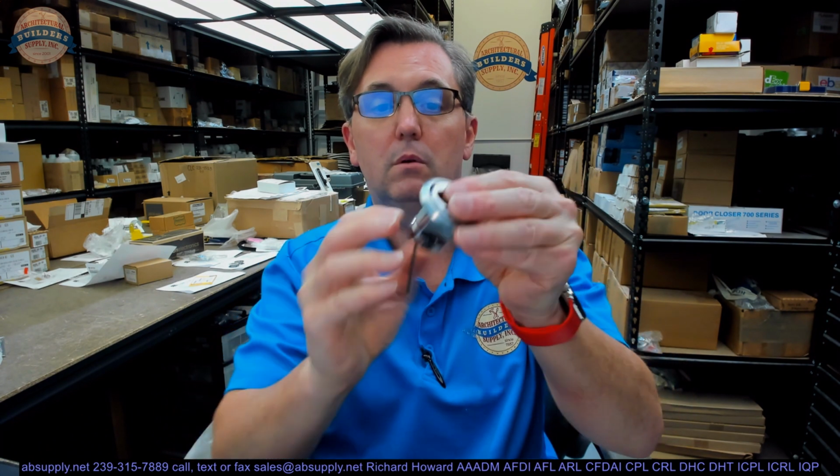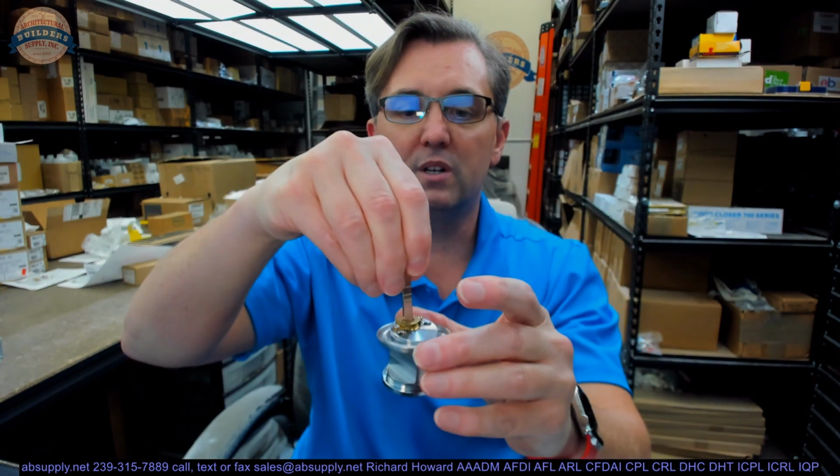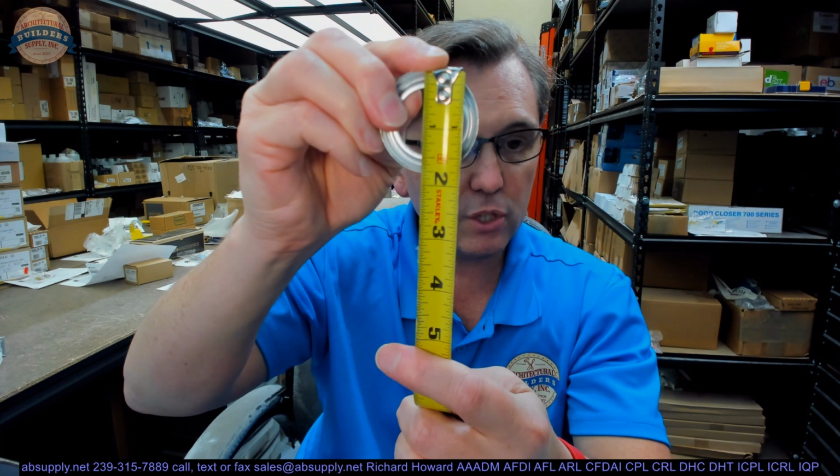It is going to include a cylinder trim ring or a collar. Cylinder collar would be pretty typical for that. It is a collar, it's a trim ring as well. You would, as a rule, install it with this on the cylinder. You really wouldn't install it without, and that's because the hole that you have to drill is awfully close to that outside dimension for the rim cylinder. The OD of the collar is about 1 3/4 inches. It's going to then finally come with the mounting plate and the 2 screws.